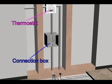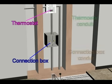We now move on to the electrical installation, which must be performed by a fully qualified and registered electrician. Install the connection box and the thermostat box according to local safety and building codes. The best position for the control thermostat box is 5 feet above floor level and as far as possible from fireplaces, direct sunlight, windows, doors, or anything that could affect accurate temperature readings.